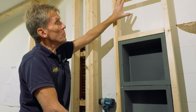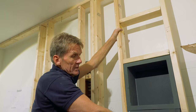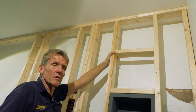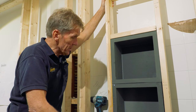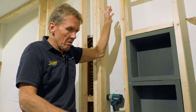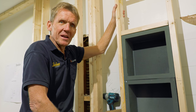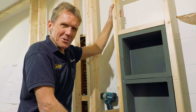I've just got to put the shower head mounting plate above the niches, marked out as per the drawing at 2.2 meters — it's a very high ceiling so we don't want to put it too low or it'll look lost. We're getting there and I'm very pleased — everything's solid. I'm a plumber not a carpenter, but I've quite enjoyed a day off from strangling pipes to do some woodwork. Another 20 years and I might be able to put my name to it.